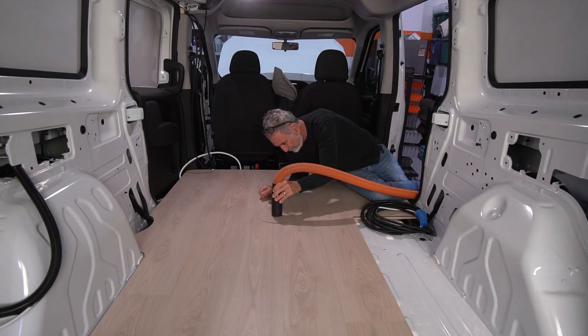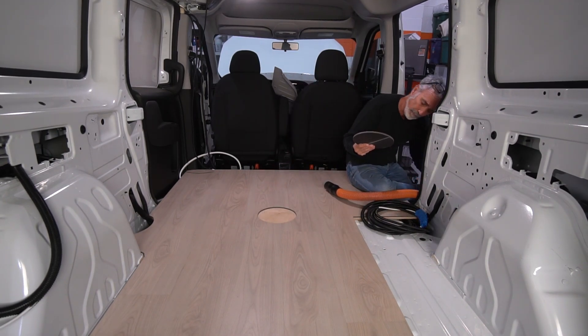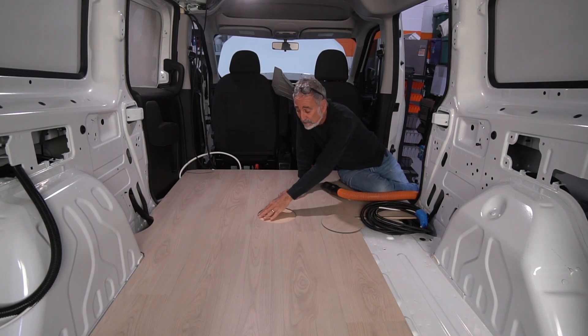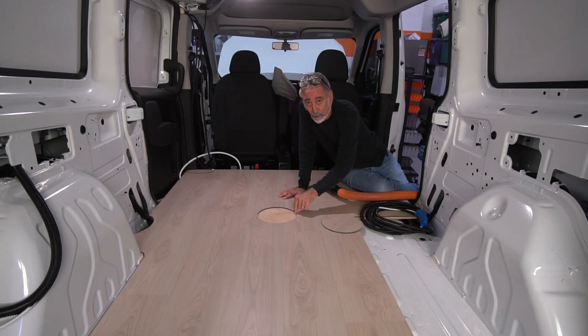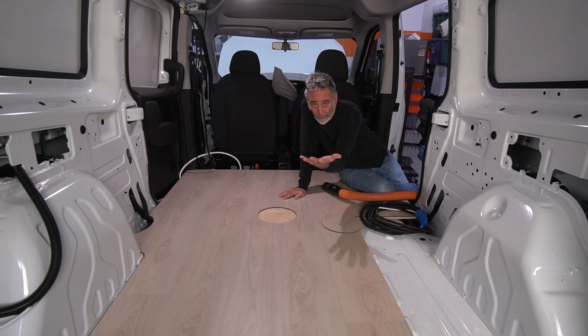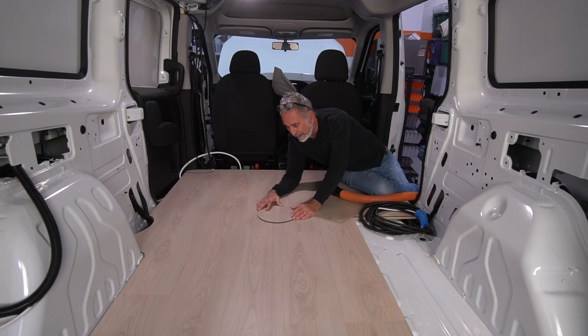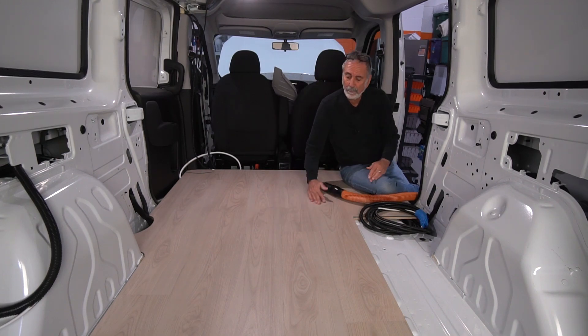There's really only one way to get it out — easily by vacuuming. Here's our finished floor: we take this panel off, and here's our subfloor. This subfloor piece is cut in a circle — the same circle — and we put silicone all around the perimeter because when that hatch is removed you can see the road underneath. We laminated the back of this subfloor piece with black laminate and then siliconed it in. To remove this, you put two screws in here and pop it off — you break that silicone seal, you have access to your sender, clean off the silicone, put a fresh bead, put this back, and line up your grain marks and you're on your way.